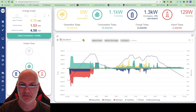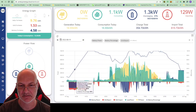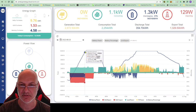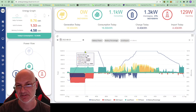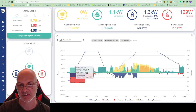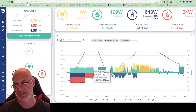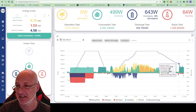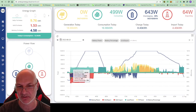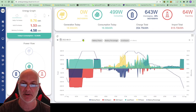I was trying to average it better over five hours — charge at a certain rate and keep going. I ended up charging the battery to 100 percent, leaving it at 100 to charge the rest of the car, then discharging the battery a certain amount in the morning. As you can see, this is exactly what I was after — recharging it through the solar. I'm discharging the battery knowing it's going to be charged back up from 30 percent to 100, trying to use the battery as a charging mechanism as well.